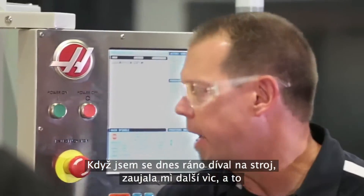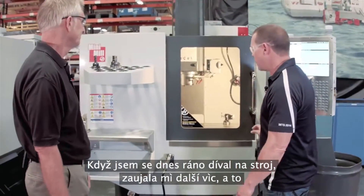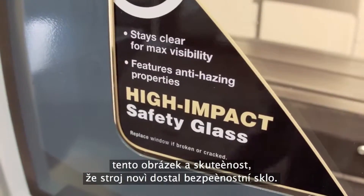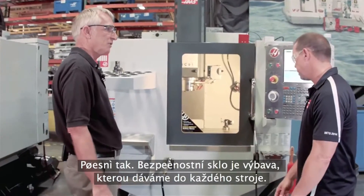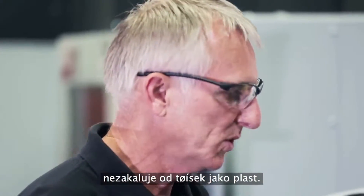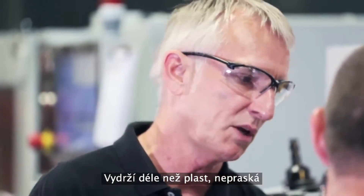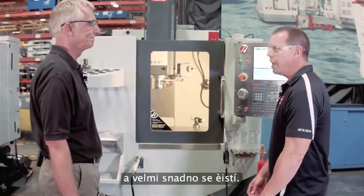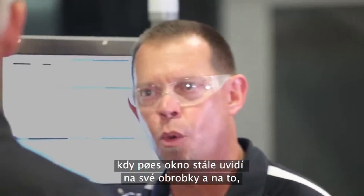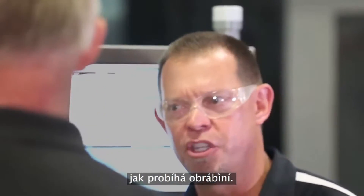When I was looking at the machine this morning, another thing that really jumped out at me was this decal and the fact that we've added safety glass to the machine. The safety glass is something we've put on every machine — it's very popular. It doesn't haze up from chips like plastic will, it'll last longer than plastic, it doesn't get brittle, and it's really easy to clean. After a few years of owning the machine, you'll still be able to see through the window and see your workpiece.